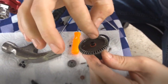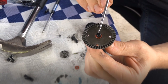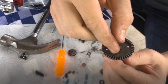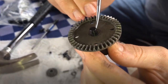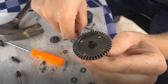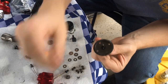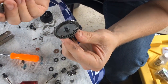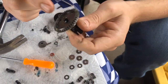Put the O-ring back in. Very good, and then put another shim. Now you put your pin in. Boom, that's in there. Centering — feels pretty good, make it nice and center. So you just rock that up and down and if there's play you probably want another shim on one side or the other. Well, that seems pretty nice — do you think it needs another one? I think it's pretty good.